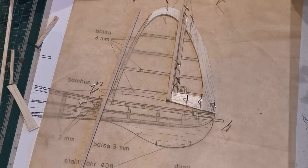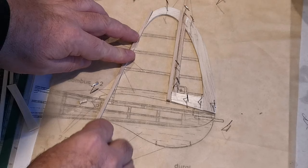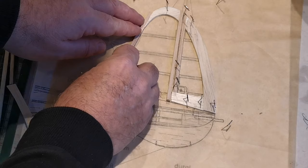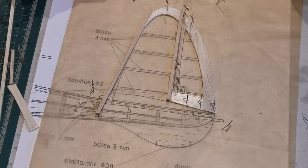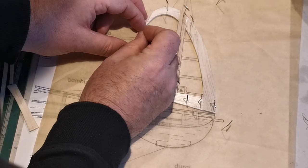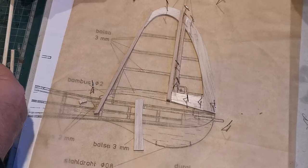What I will do, so that I don't mark the edge of the wood with the pressure of the pins, is use some bits of scrap and hold them in position. I'm going to cut it longer than it needs to be as well, which will aid in the pinning. So if I get some glue on — it's slightly longer, you'll notice. I need a pin in here, so let's put a bit of scrap in. I don't want the scrap to get in the way of other parts — let's try a bigger piece of scrap.